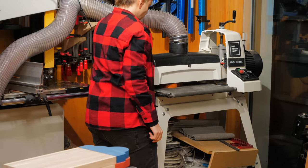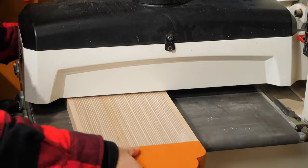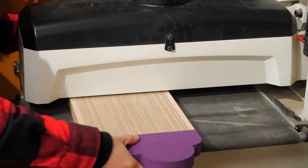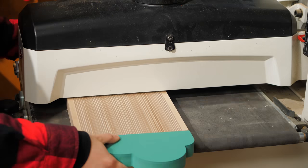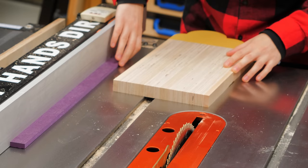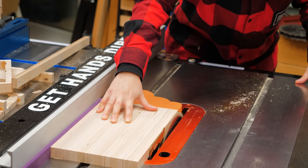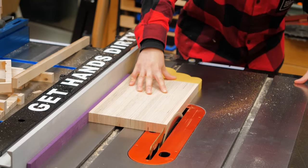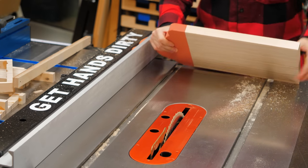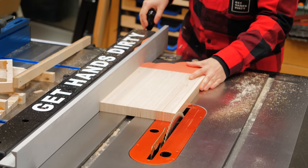While the glue was drying, I ran the boards over the drum sander again. I needed to level the clouds with the plywood area. I drew the clouds slightly bigger on purpose, so I have to trim them now. I can't just lean the board against the fence because of the protrusion on both sides of the cloud, so I use a straight scrap of wood to guide the plywood area and keep everything parallel. With one side flush, I could run the second side through the blade normally.